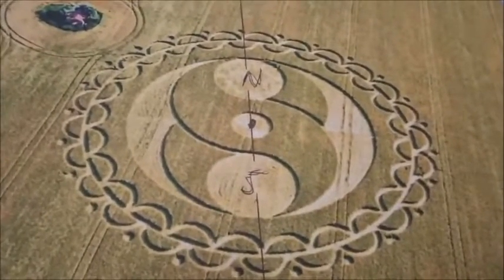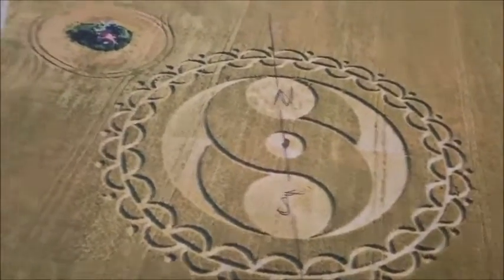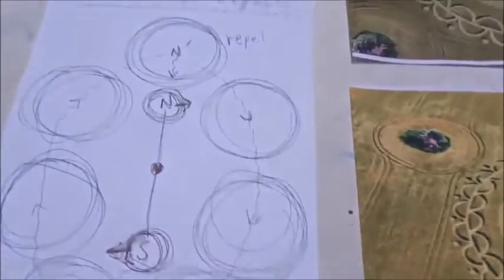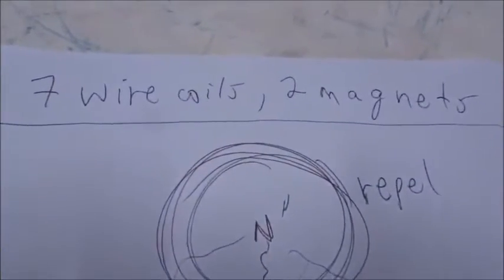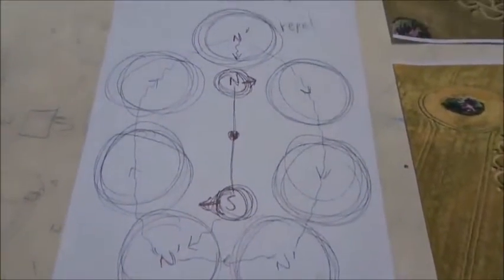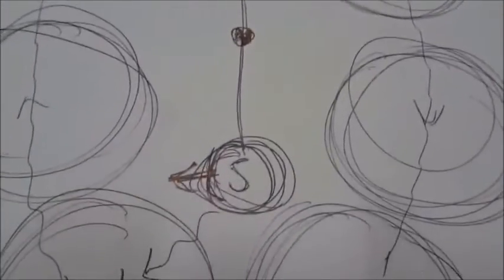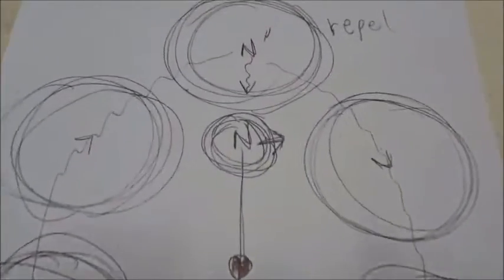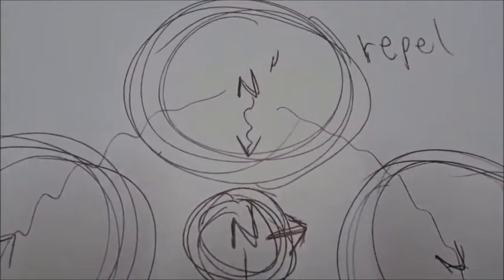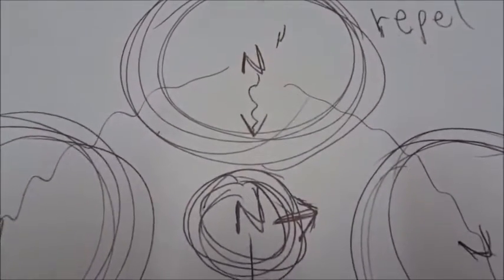In order to simulate this, I really need 25 coils. I only have 7, but we can do the same physics with 7 coils just to get started. So we'll start with 7 wire coils and 2 magnets arranged in a circle — a big N magnet going one way and an S magnet going the other. The key is when the N magnet goes past a coil, it generates current and that creates a new electromagnetic field by Lenz's law, called N'.